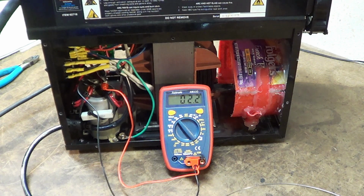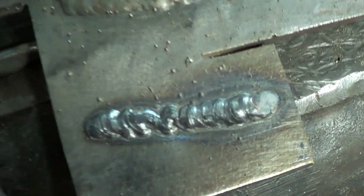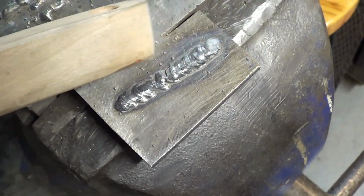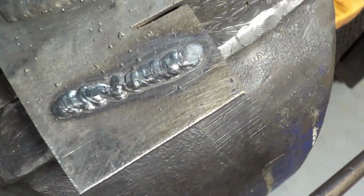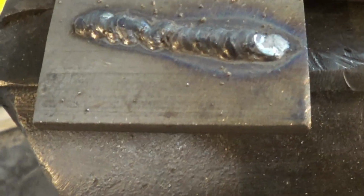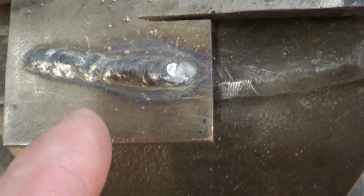And you can see it discharging well. Just brushed off the flux. So the little bit of BBs that are right there, I ain't touching it, sorry y'all, those are new. Those actually came with this weld. But you can see, if you own this machine, they're quite a bit smaller than what you had. It's not the world's greatest bead at all. It's a little bit lumpy and irregular there in the middle.